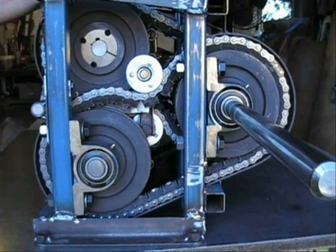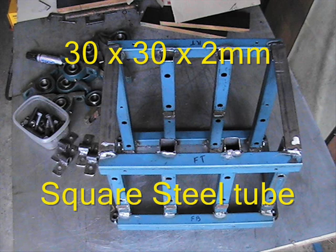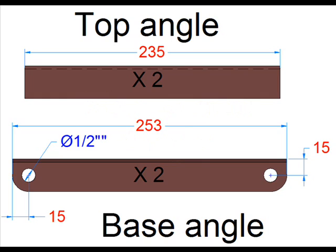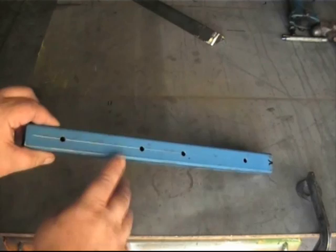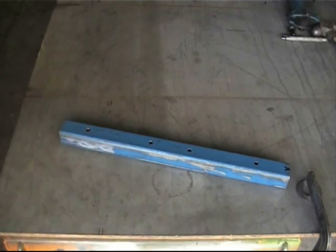So now, if you blokes are ready, let's start building our transmission. As with my previous transmission frames, this frame is also constructed from steel tube and angle, with welded joins to provide a strong and rigid support for the various components. The bulk of the materials used is 30mm square tube with a 2mm wall thickness. The base and top braces are made from 30mm angle with a 3mm flange thickness. For accuracy and ease of construction, it pays to pre-drill all your mounting holes before assembly, and the best way to do this is to make up a drilling jig. Often the best way to make this type of drilling jig is to first accurately drill one of your posts, with the base clearly marked for orientation, and cut to the precise length.